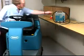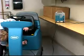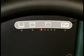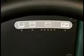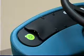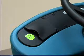Note, do not charge batteries more often than necessary. Excessive charging could reduce the life of the batteries. It is best to charge the batteries only when the left light indicates that the batteries need charging. After the low battery charge indicator starts flashing, you can still press the one-step scrub button for an additional minute of operation to pick up standing water or other non-flammable solution.